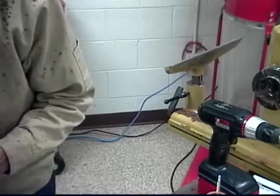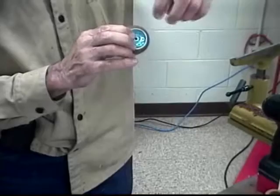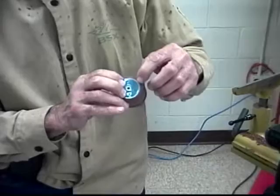Check your cover. It's pretty good. The shaft has to come just inside your cover, but you don't want to stick it above the cover, because then when you put the cap on, it'll hit the plastic insert and then the steel top will be loose. So if you stay with the 2 inches and round that over just so you meet the top edge, but don't shorten it, you should come out pretty good.